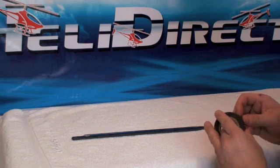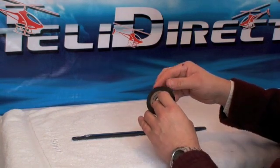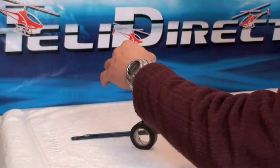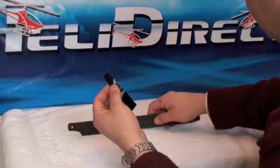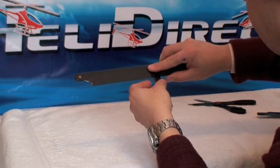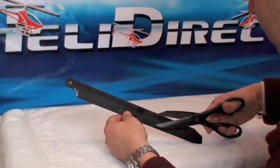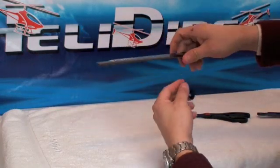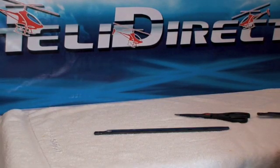Go ahead and get some tape. This tape runs about 0.075 grams per inch, so about 4 inches should be about 0.3 grams — we'll eyeball it. Take the light blade and start on the back of the blade, placing the tape centered on our CG mark, then wrap it around so it lays flat. The lip of the tape wants to be in the slipstream of the blade — not pointing outward, or as it spins it'll pull the tape off. Done the other way, the airflow pushes the tape down.